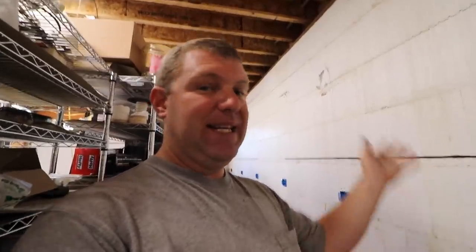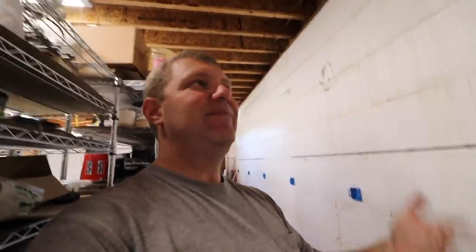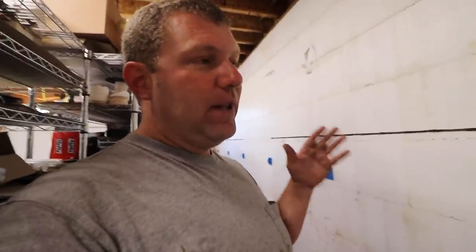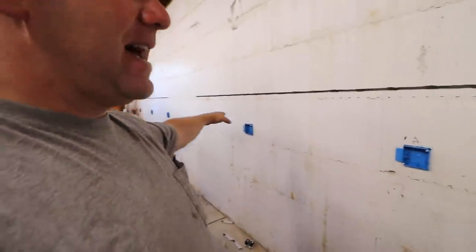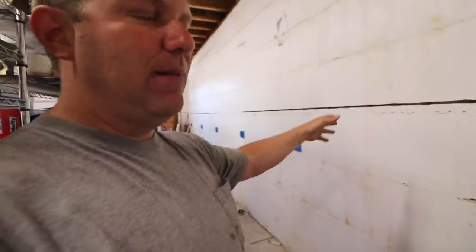For those of you who've been joining me, I heard from the inspector this morning, and he has no issue with us painting that conduit. So that's out there drying right now. We'll keep an eye on that throughout the day. Once that's painted, we can of course get it installed and get wire pulled through again. That's the problem with getting ahead of yourselves, double work. And then we can get the outlets hooked up. So hopefully by the time we have to call it quits today, we'll have outlets in all of these guys, and we'll have wire between them all, so they'll all be daisy chained together.